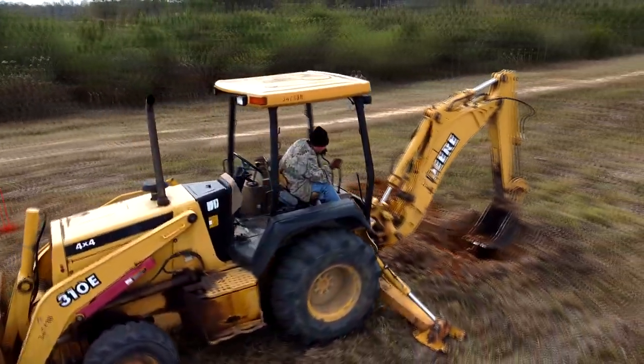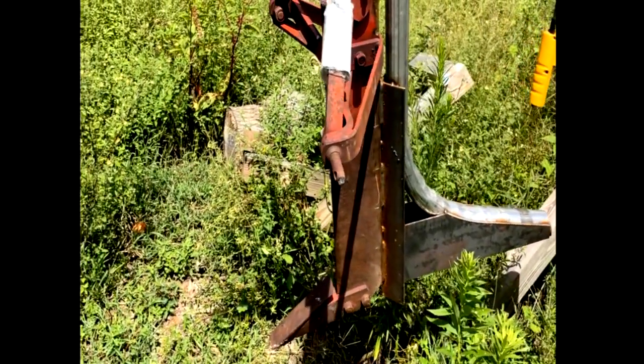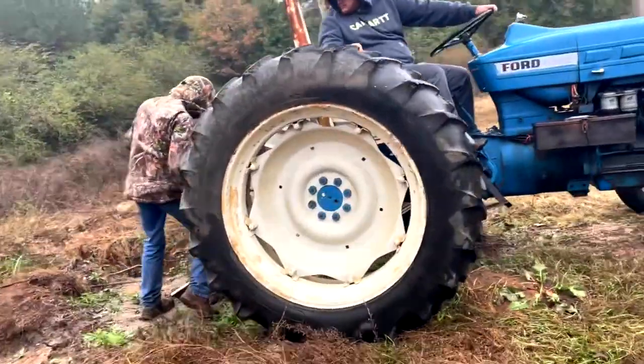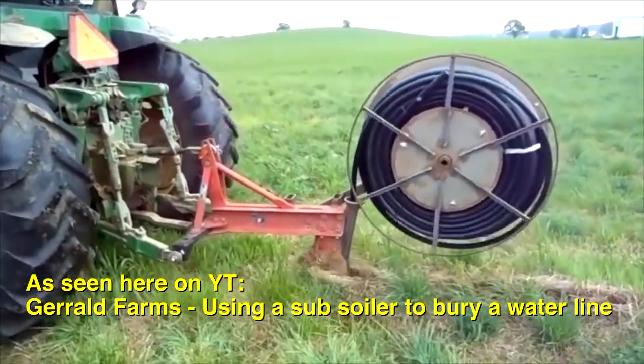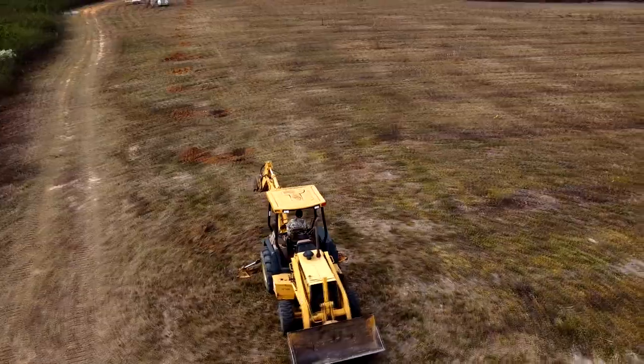Frank is here and just started digging all of the holes for each tee in front of each row of trees. My brilliant idea is this: I've got a thing called a ripper — it's like a big heavy piece of metal, kind of like a knife. You put it on the back of a tractor and it rips through the earth. It's got a two-inch tube on the back. My plan is to drop it down into the earth, have the tractor pull it through, and thread my water pipe down through the top of it so it lays under the earth — cutting a trough for the pipe, laying the pipe, and covering it up very quickly. Frank's going to cut 32 holes in front of each row of trees. I'm going to run the ripper over the top of that, which will expose the pipe so I can cut it, drop my tee in, and Bob's your uncle.